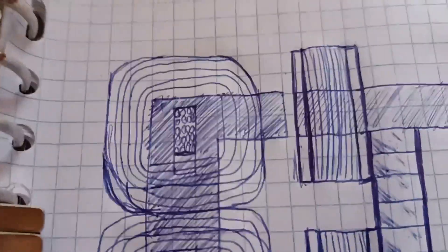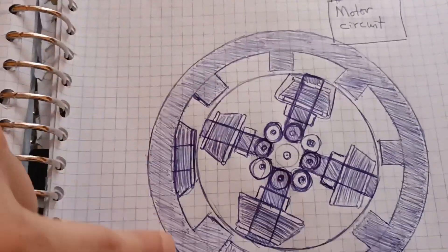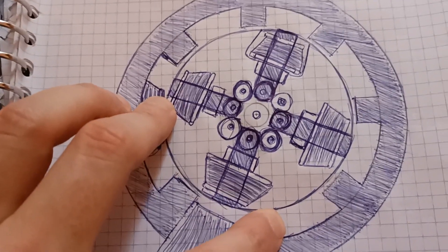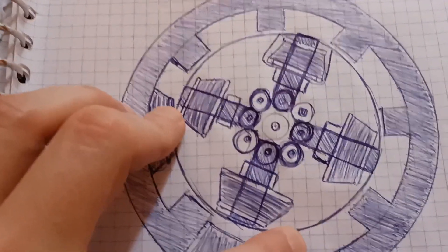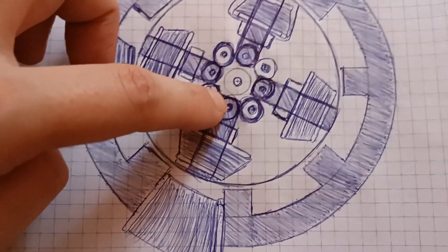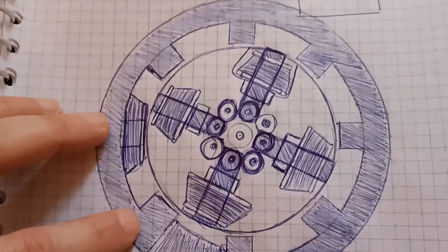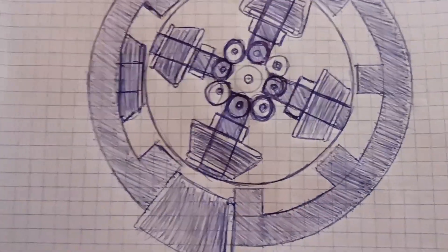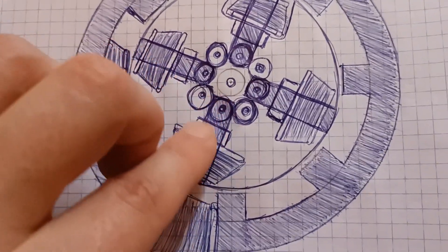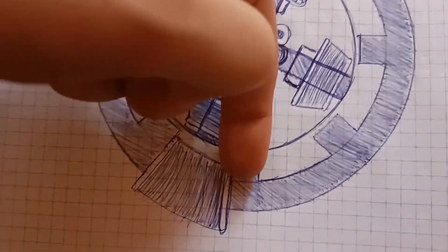In this generator I've also drawn coils on the inside — it will be a very big circle going all the way around, a big fat coil with induction from four pole pieces simultaneously, which will be very interesting. So to recap: we've talked about the motor, the switching magnet configuration of the rotor, the generator with all its coil positions and generating possibilities, and the torque — centripetal force going inwards during the motor action, then slapping back into a centrifugal force when going into the generator section.